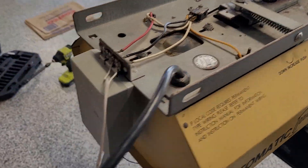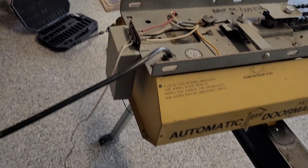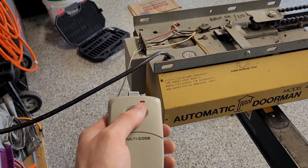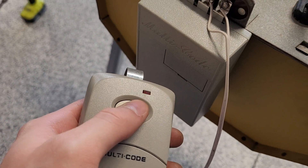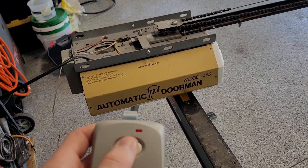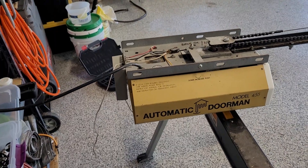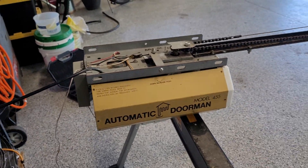We've got the original light lens, nice and white. I have this Multicode 1090 receiver on the back, and I think this receiver is bad. I have a 3089 that is programmed — when I push this button, the receiver clicks, but nothing runs. I think this receiver is bad because I have used this receiver on this opener before and it's worked perfectly fine, so I'm going to have to get a new one of these. I don't know if they have a warranty — this receiver is like three years old, so maybe not.